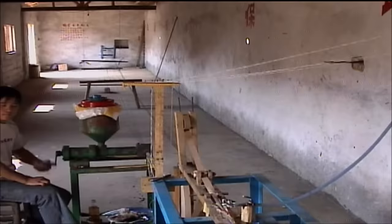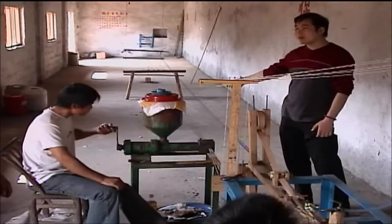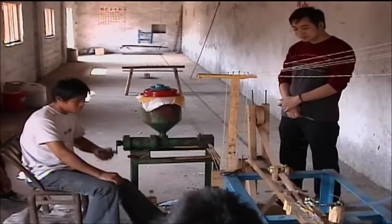The process starts with five soft, untwisted cotton strings being run through a slurry of black powder. The slurry is constantly agitated by a worker to keep the black powder from settling out of the mix, thus ensuring a thick, even coat of powder on the string. After passing through the slurry, the strings travel out and back the length of the long, narrow room. This allows the powder to dry slightly before the string is encased in its paper sleeve.